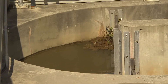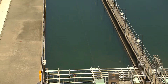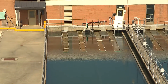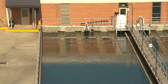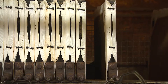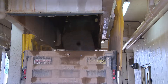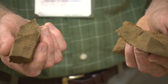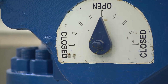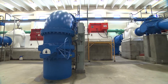And the next step is sedimentation. In the sedimentation basin, over time, all those particles that we've formed settle out and fall to the bottom of the basin. We have clean water that comes then to the filters to be filtered — our students just did a filtration exercise, so that concept should be familiar. After the filters, it filters out any suspended matter and oxidized metals, and once it gets through that, it's clean drinking water. Then we add chlorine to the water to disinfect it so that it's safe to drink.